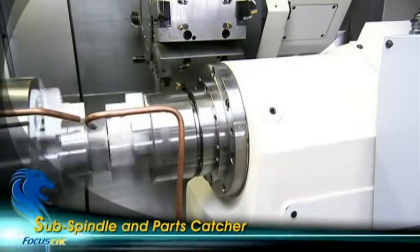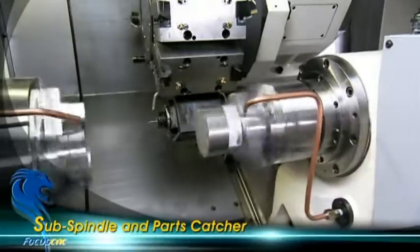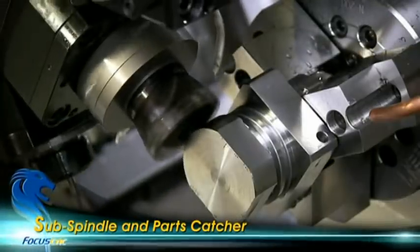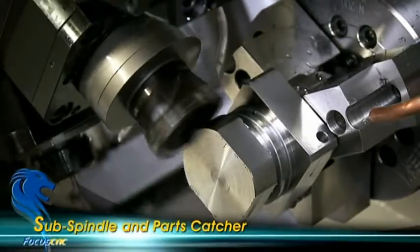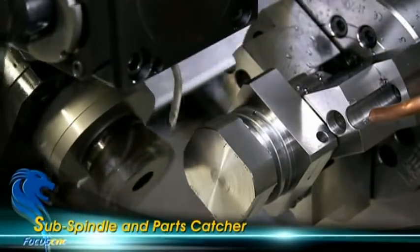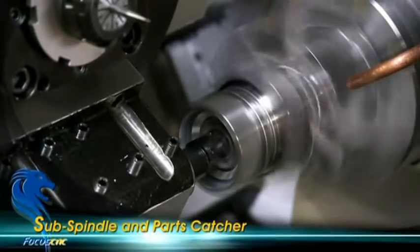To add to the versatility of the FNL 250SY, Focus has added a sub-spindle with built-in motor for instant back machining and has included 2 parts catchers on this model to allow parts collection after either front or back machining have been completed.